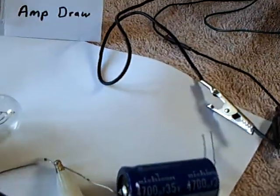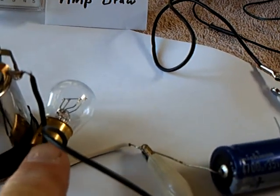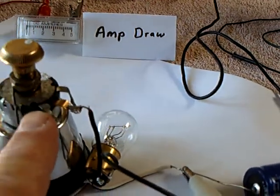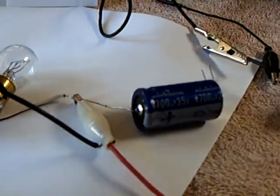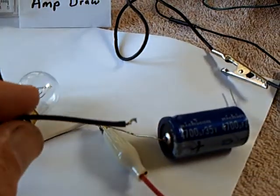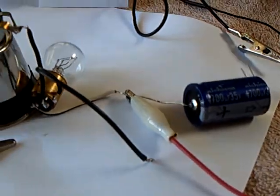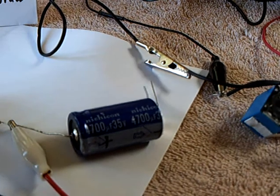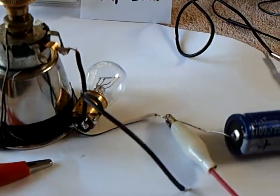I've tried Mark Hale's bulb and it works quite well as a ballast resistor. I'm using it with the rheostat, and it does help the heating — the control is much better. I also wired in the other wire. This is a two-filament bulb, so you basically have a two-brightness system if you want to attach the other filament in there.